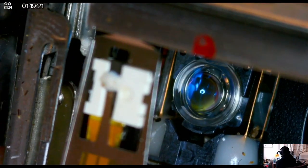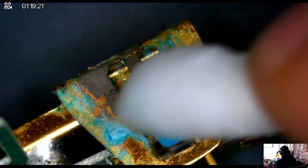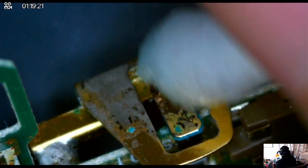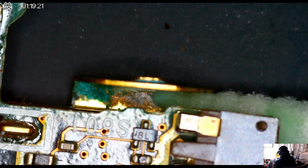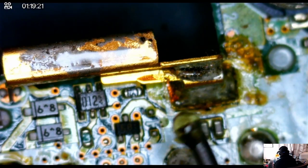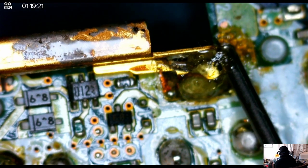This is the sensor that reads the minidisc itself — it has a little bit of flakes in there. Here's a better view on the other side of the battery terminal, which is full of corrosion as well. I'm trying to dab it with distilled white vinegar from the cotton swab, going at it for a few minutes trying to get as much off as possible. There's still more corrosion at the edges that will need to be dealt with. I'm now injecting some white distilled vinegar directly using a small syringe, trying to get the reaction to happen there, and I figured out that maybe the best approach is to just remove this terminal and get it clean that way.